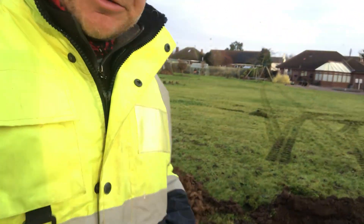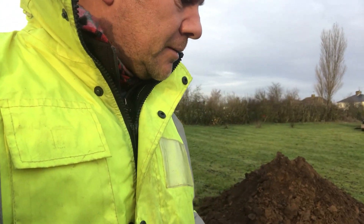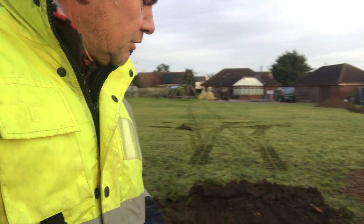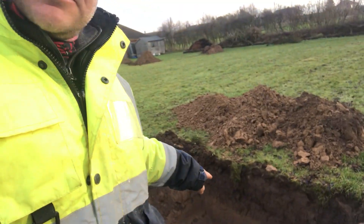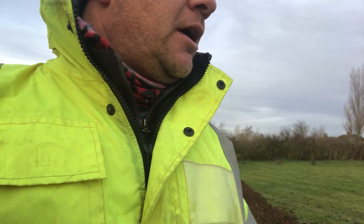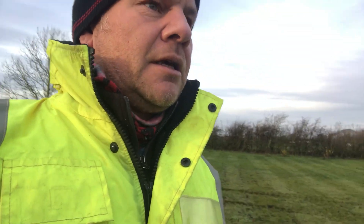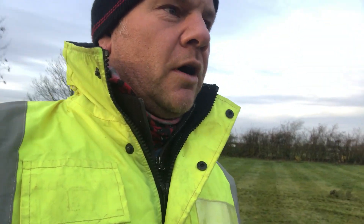This is the first hole — again, you can see we've just started to hit the water, so we're not going to dig down that deep. We'll go down about 600mm, just enough so the foundation sits on top of that lighter brown soil. That way we shouldn't be hitting the water table or getting trenches collapsing, which makes it a lot safer to work in.